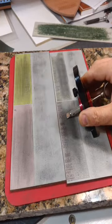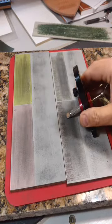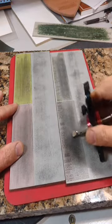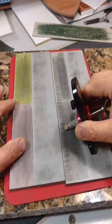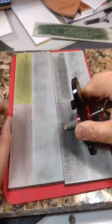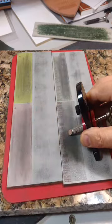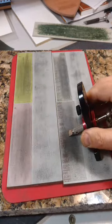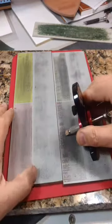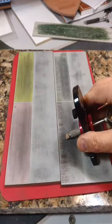This is a little bit different than most of us learned about sharpening knives when we were taught to sharpen against the edge of the blade, which would help in the burr removal. As you sharpen, a small burr starts to form on the cutting edge, and by cutting in this direction into the edge, then that burr can be sharpened and fall off.